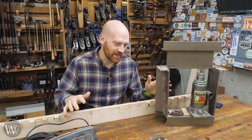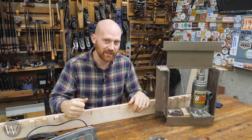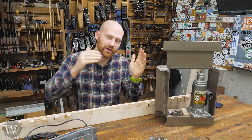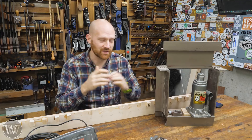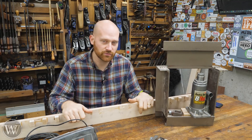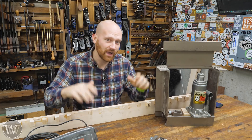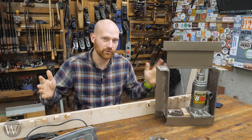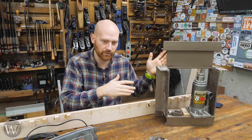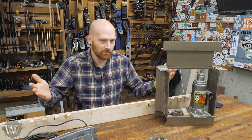If anyone's new to the channel, over the last several years I've been testing a whole pile of glues over a range of different applications. We've tested 64 different glues — long grain to long grain, long grain to end grain, gap filling, and exterior conditions — making as many samples as possible for a large sample size. There are thousands of data points now on the glue testing sheet, which I'll link below, as well as the latest video going over all 64 glues and their results. Some of the results have been absolutely mind-blowing. Things you thought would work well really don't, and things you'd never think of actually do really well — like cheap superglue, which held up phenomenally well.